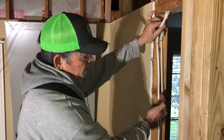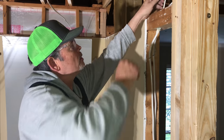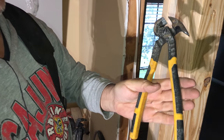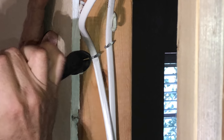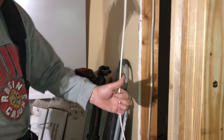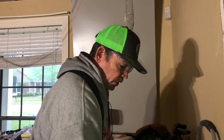I only need to remove the staples from the one we're going to move. I remove staples by one of two methods: a standard nail puller, or some offset diagonal cutters — I'll show you both. These offset diagonal cutters work great if you're in a tight spot. Just grab the edge of the staple, push, and it acts like a little crowbar — pulls that thing right out. With the nail puller, grab the edge, always careful of the cable, and pull it straight out. Make sure those go in the trash — they're deadly. So now our wire is not stapled at all and it's ready to be pulled out of this receptacle. We're not going to cut it — we're going to disconnect it.